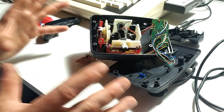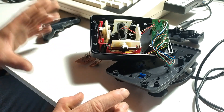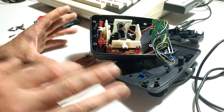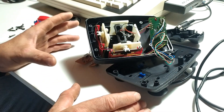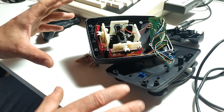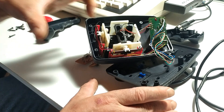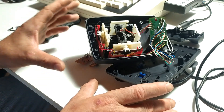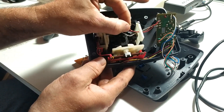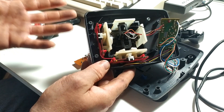After pulling it apart, I tested this joystick on my Apple II using a little adapter I made. The up, down, left, and right were working fine, but neither of the fire buttons were working. The reason was a little break on the ground line. So we're going to repair that and then we'll have a working joystick that we can convert for the CoCo.